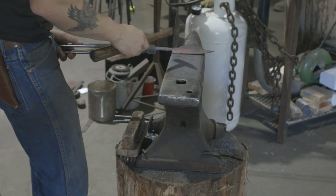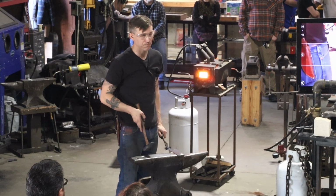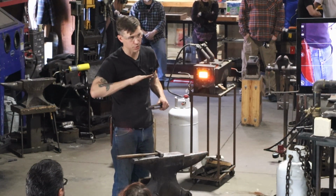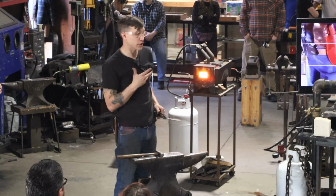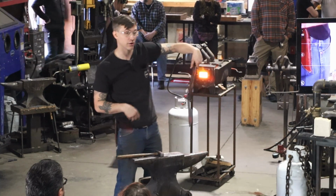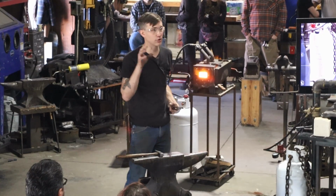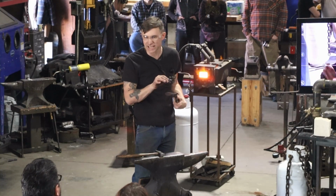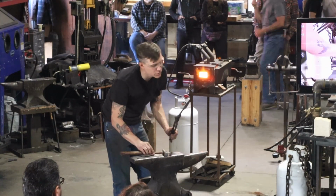There was a question about decarb earlier. I have found that it is plainly visible in steel, even if the steel is completely ground clean. Especially when you get to a higher grit, there's these little dots and stuff in it. Decarb is very clear. If you really don't know and you're concerned, dip it in ferric chloride. Your etchant that's for Damascus, and your decarb will be light gray, and your steel will be black. So, light gray in the etch or just some mottling texture in the surface when you're grinding is very obvious. I mentioned that because obviously my tip is real thin, but like I said, it'll probably look thicker once it's cooled down.